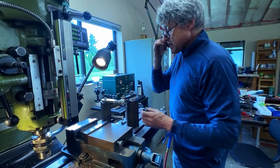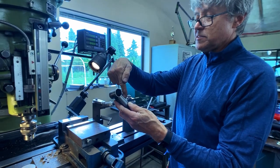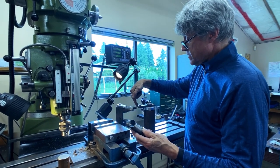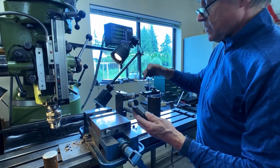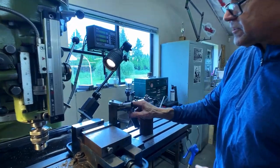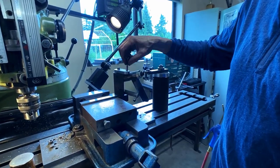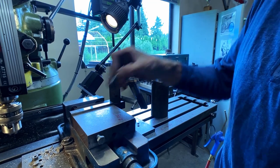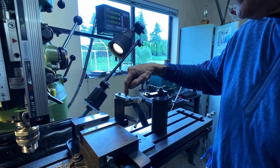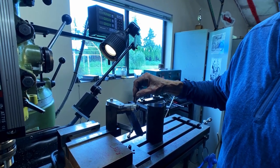What this does: I have a tool that comes down that makes the slot. Because the tool is hitting this at an angle, it wants to bend out — it wants to flex the tool even though it's fairly strong. So this piece here gets set at the right height to hold the tool in line. You can see how the clamp tube fits over this. I mount this piece of carbide — it's basically a quarter inch rod — I mount that into the chuck, put the chuck in there. I have a measurement here: it's 2.5 inches — I have to move this over 2.5 inches, and then I should be in the right position to make the slot.